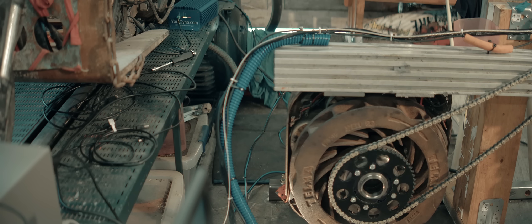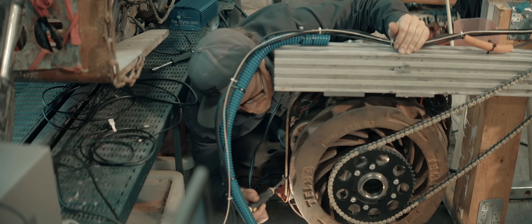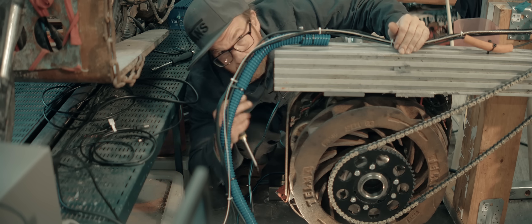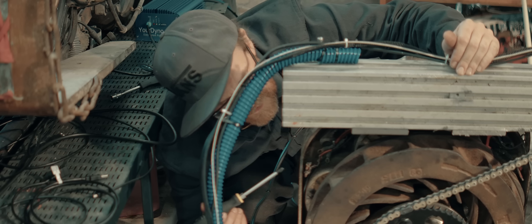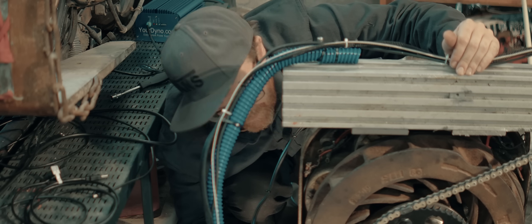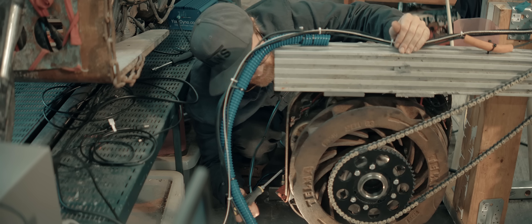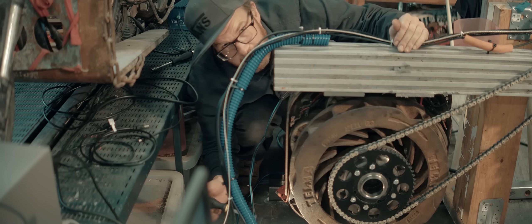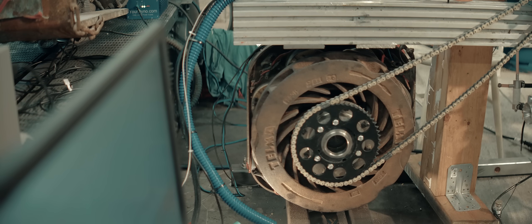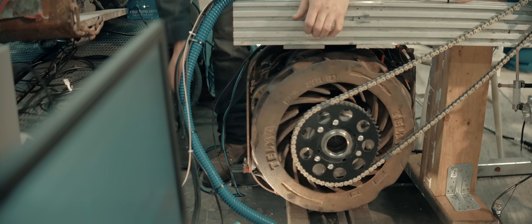Better turn it off — it's smoking. It's the same problem as with these two coils. The wires are broken all the way in there where it butts up against the frame. Not an easy fix. It seems impossible to get these coils off the cores and do repairs back there. Might have to disable this pack of coils too and wait for the next pack to fail. I've disconnected the coil with the failed connection, and now it's working. The joy of aluminium wires.